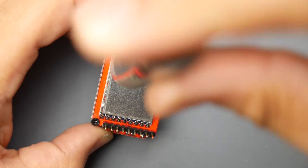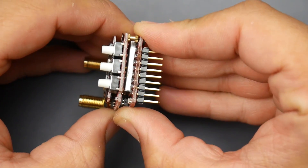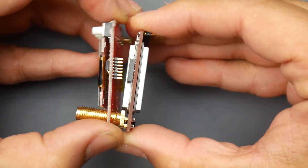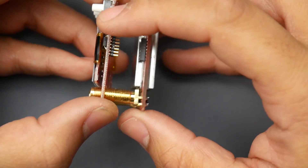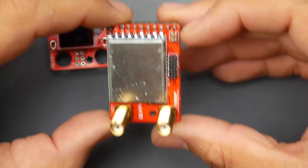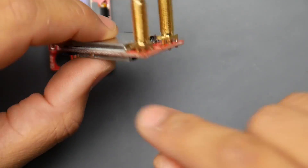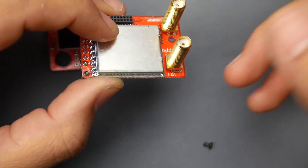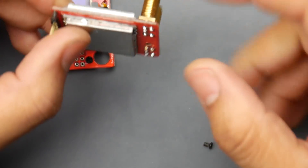Let's take a look inside — hopefully we can see the microcontroller unit. I don't think it's an STM32 like the F1s and F0s; I think the MCU is possibly an Atmel-based CPU, not an STM32. To remove the board we just have these pins that pass information from the receiver to the board up here. On the bottom it's pretty basic — two capacitors and both modules, since this is a diversity receiver. The distance from the antenna part of the module to the SMA is really short, which is a huge plus.